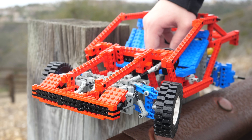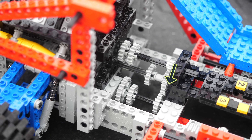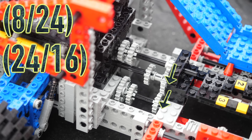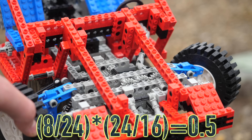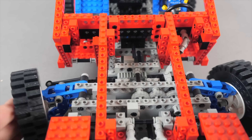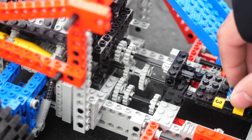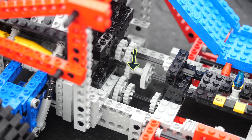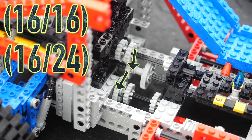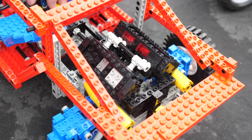Let's look closely at the one in the 1988 car chassis. In the first speed, the motion from the engine travels from the 8-tooth gear to a 24-tooth gear, then goes from that one to a 16-tooth gear. Simply multiply the two fractions together and you will get 0.5 in the first speed, meaning for every full rotation the output will turn half of that, which is 180 degrees. In the second speed, we just have two same-sized gears, so we can ignore that, and the path travels from the 16 to a 24-tooth gear, which is just two-thirds. In the third speed, the motion goes from a 24 to a 16-tooth gear, which is just the same ratio but flipped.